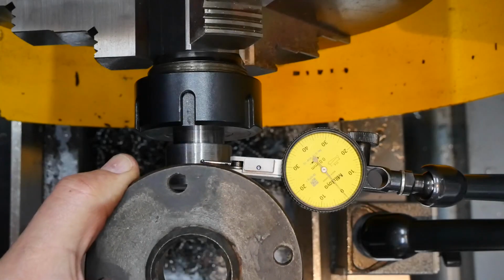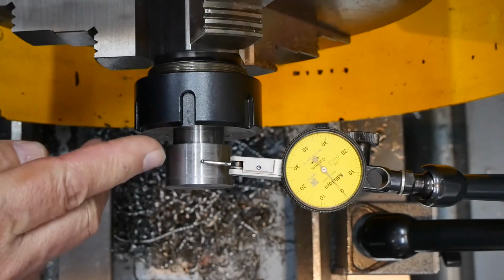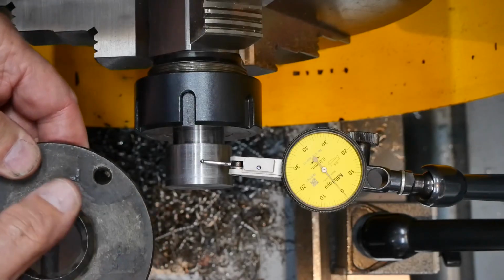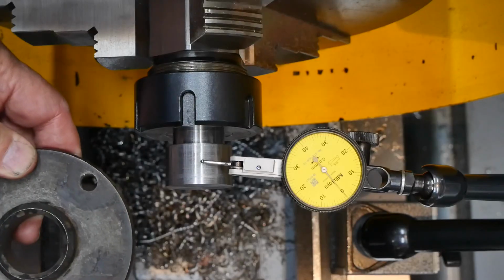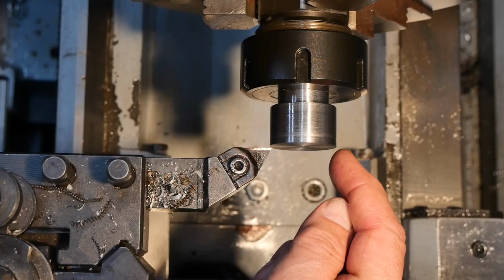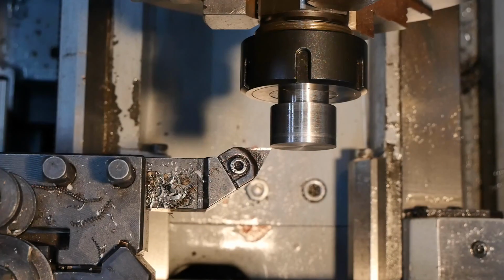The bore of this flange measures 29.71, so my plan is to machine a spigot with a diameter of 29.73, so it should be quite a firm press fit on here. Once I have this mounted on there, I'll drill the bolt pattern to match the plates that I'm making. I'm going to start with a cut that will take about 1.5mm off the diameter and bring the OD down to 31, check the DRO calibration and take it from there.